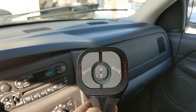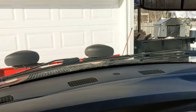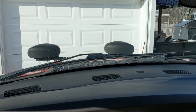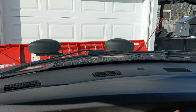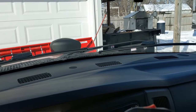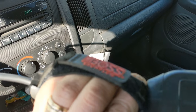Now that our plow is connected, you can see the light is back to green. We simply push up and the plow raises, double tap down — down and float — double tap up, goes up all by itself. Some of the older Boss plows don't have this feature, but usually any of the newer controllers that have this strap will have that feature.